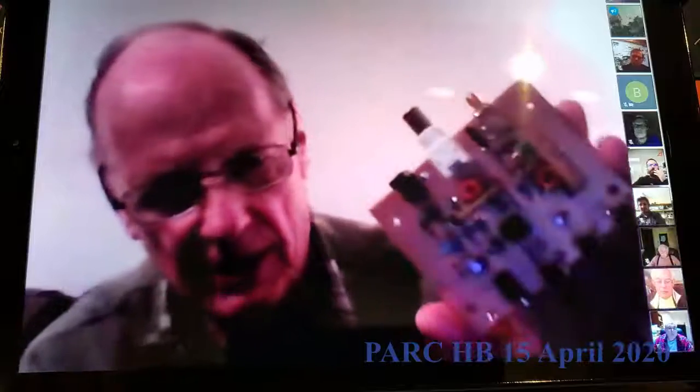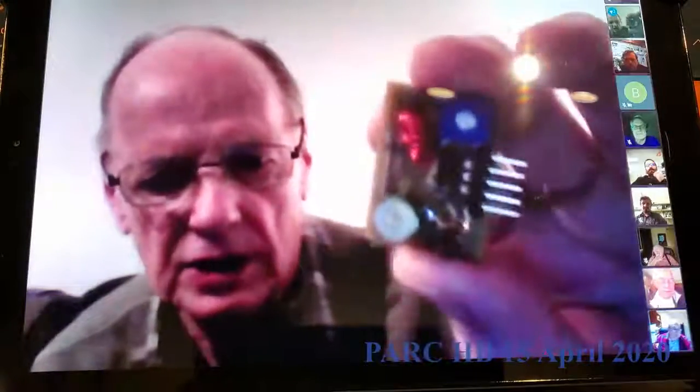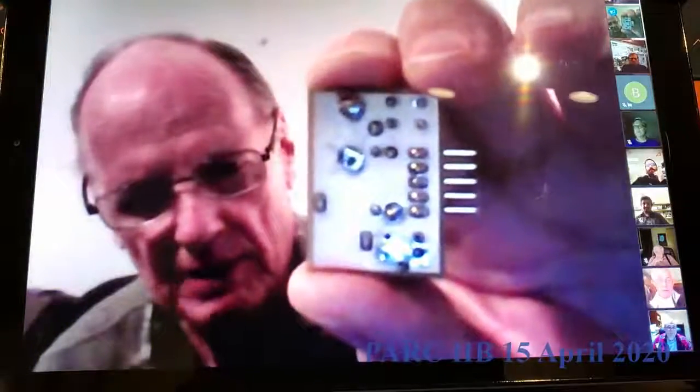And then if we look over this guy here, that's the built-in VFO. We'll pull him out as well. Same design, 5 pins, a little bit more complex, a little bit more tight in the design. And once again, by changing the value of the components, in this case, it's just the toroid that will have to change. And you can get it on various different ham bands. Plus any other band you want to listen to, for that matter. There's the back of it.